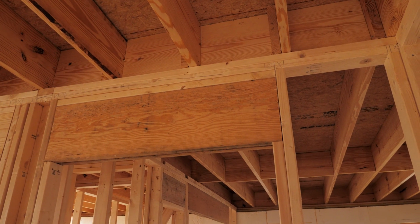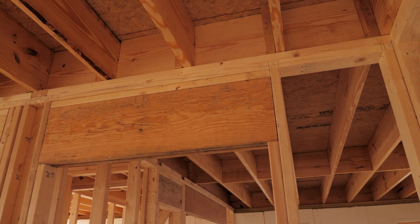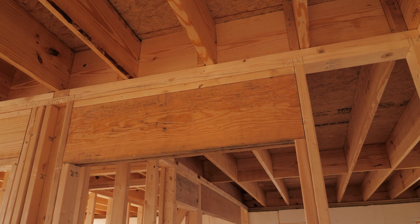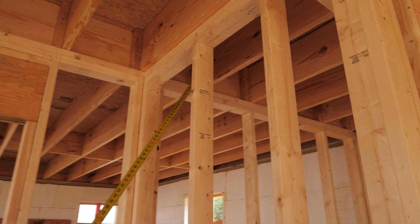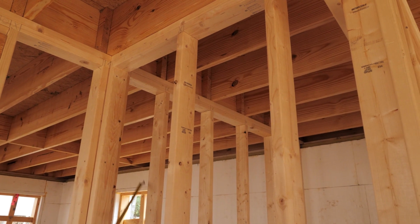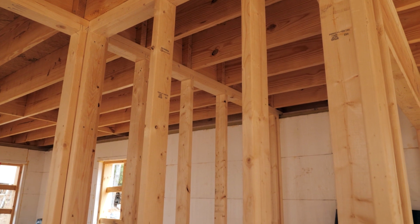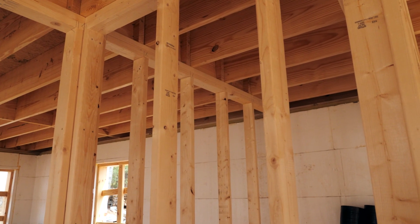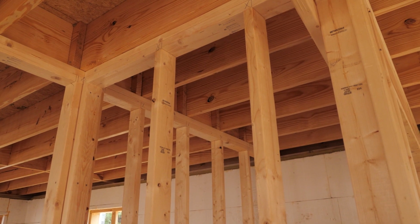Right, so the whole house sits along that center line, which all transfers down to the beam and the posts in the basement below. So that gives you your sturdiness. So then we try to line up our rafters and floor joists so they stack above all of our studs, so we pull the same layout, so you have inline framing, they call it. Every joist falls on a stud, every stud sets on a joist below, all the rafters, all the way to the roof, right?